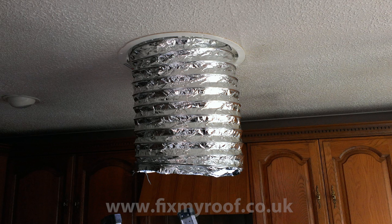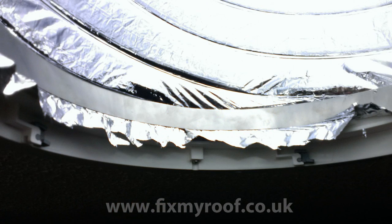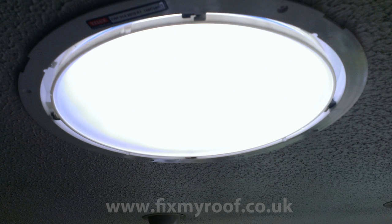Right, the outside is done — now for the good bit. Carefully pull your flexible tube into the room from underneath and cut off any excess with some tin snips. Once you have pulled it reasonably taut, insert the metal spring clip back into its original position. You can now, by a process of releasing pressure on the spring clip and gentle pulling, tighten the tube and remove a lot of the wrinkles. Once you have the desired finish, fold the cut edge of the flexible tube back onto the spring clip and tape it into position with the reflective tape provided.